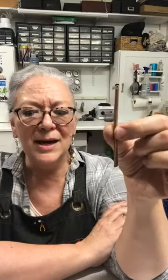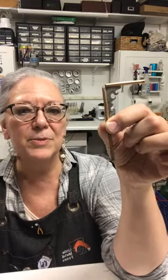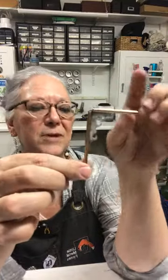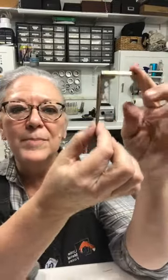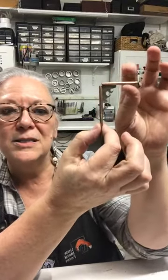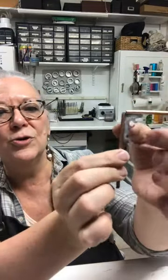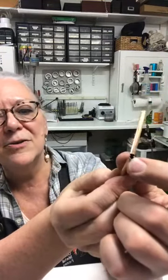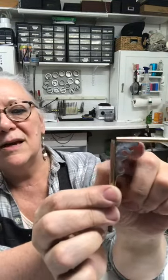Mouth atomizers, like I said, you can buy, you probably can get them on Amazon. You can get them for all kinds of purposes, and I'm sure you could get one from pottery supply and painting supply places. But this one I made myself. It's made with two pieces of 4 millimeter tubing. This is brass tubing right there, and the vertical pipe has a 3 millimeter tube soldered on the inside, and then I've just got it at a right angle.